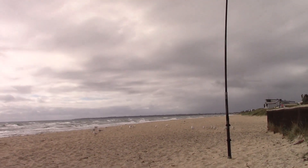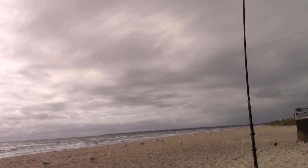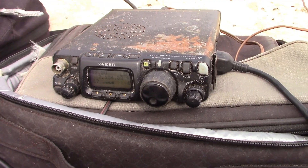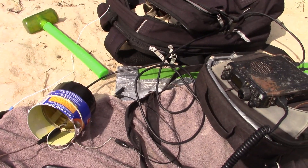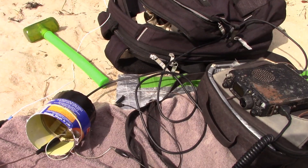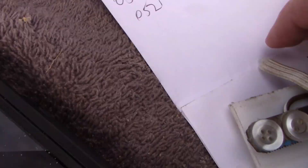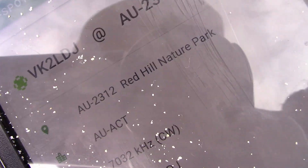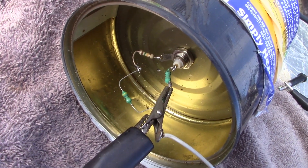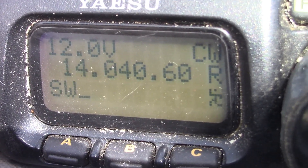Great to hear your setup is working well, and good to know that you can spend the least amount of money as humanly possible. This is VK3BO. You're about 5 and 6. Calling CQ, CQ, CQ. Good day Peter, where are you? Portable. VK3YE, VK3HP. VK3YE portable, calling CQ and listening. I've just gone down to the lowest inductive setting of the 1 microhenry, and after a bit of fiddling I've got it to reasonably low SWR on 14 megahertz.